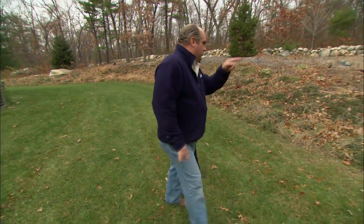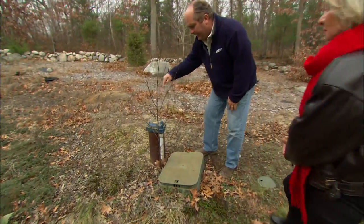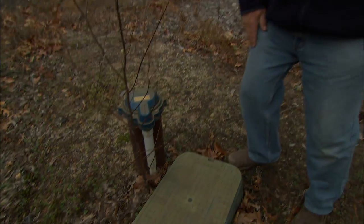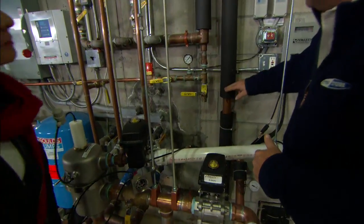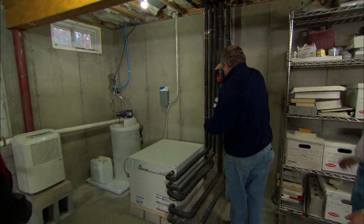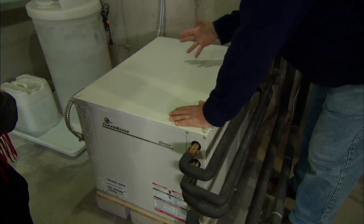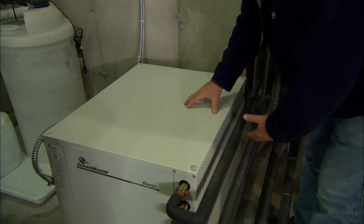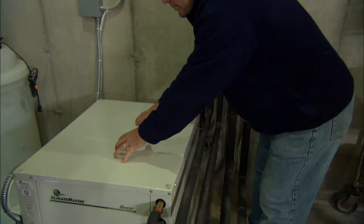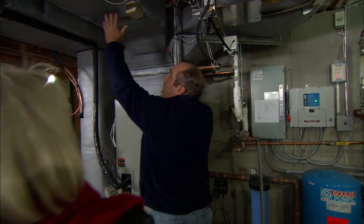This homeowner chose to put a well — this one is actually about 400 feet down. At the very bottom there's a pump, and it's going to take that water and pump it up into the house where we can use it to heat the building. The pipe comes in right here — here's that 50-degree water coming in. It comes across the ceiling and down into this heat pump right here. Inside this heat pump there's a heat exchanger and the basic refrigeration equipment we see in every refrigerator or air conditioner. The heat exchanger picks up that 50-degree temperature and it gets absorbed into the refrigerant. When that refrigerant gets compressed, it can get really hot — that 50 can become 120 or 130 degrees. That hotter refrigerant comes over here, and when air blows across it, it can heat the air enough to heat the building.